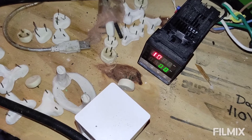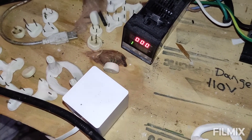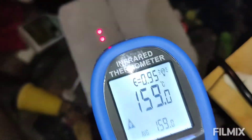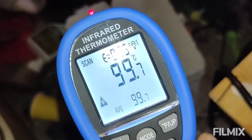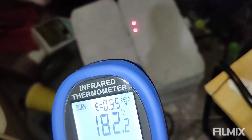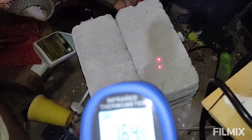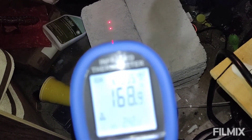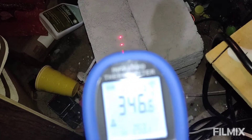We're going to try to get it up to 1077°C for bisque firing — cone 04. Getting close. The kiln is still doing pretty well on the outside temperature, so this homemade brick is handling it okay. Certain parts of the exterior are maybe 150°C, other parts are 300–350°C, which is kind of hot, but for homemade brick it could be worse.